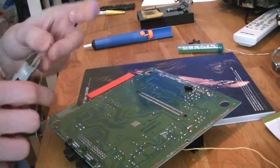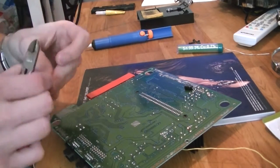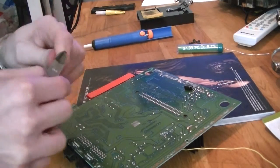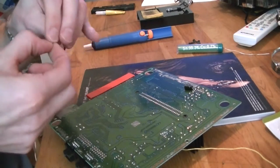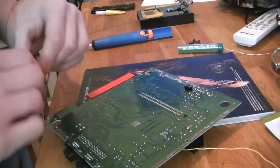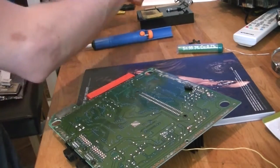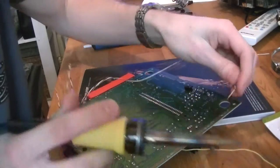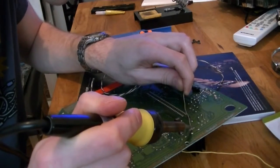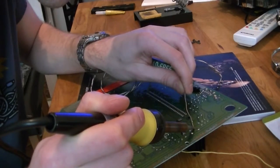I just need to prepare the wire — I should have done this before really. But again I've got this wire just from a spare ribbon cable I had lying around. It's very useful because it's small. Obviously if you're soldering to small circuit boards like this, it's handy to have small wires rather than big fat ones. Just prep that with a bit more solder — it's kind of old stuff, probably going on 20 years now this solder has been on here. So just add a new layer there, make sure it's nice and shiny.